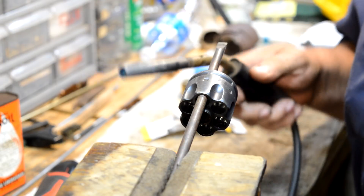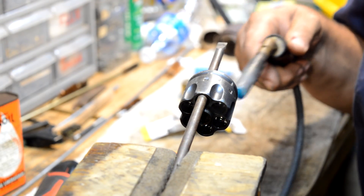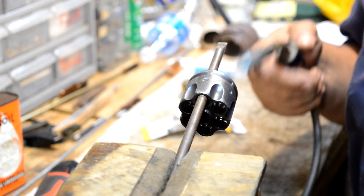I've just got to be careful about dropping drill bits down in there. We're going to put a smaller diameter drill bit down there and see if we can persuade that sucker to rotate and fall out. I might put a little bit of heat on this — not enough to draw the temper — put a little bit of penetrating oil in it, wave my magic wand at it, and do some of that gunsmithing work.